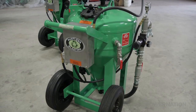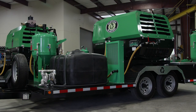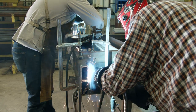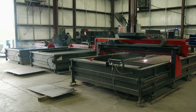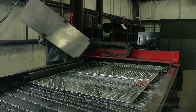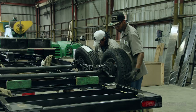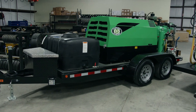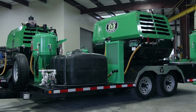Dustless Blasting equipment is available in dozens of configurations, from smaller units on wheels to massive layouts on dedicated trailers. Just like the blast tanks, the trailers are built at Dustless Blasting's facility. They are custom designed for the layout of the blasting equipment, and everything is organized for ease of operation in the field. Diamond plate steel and aluminum are cut to size for the toolboxes and trailer floor. The towing equipment, heavy-duty axles, and eight-ply tires come next. The total weight of these mobile blasting systems ranges from just over 4,000 pounds to almost 10,000, and these trailers are built to handle it.